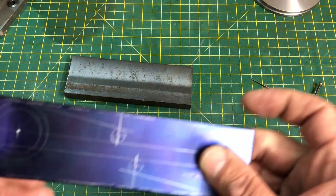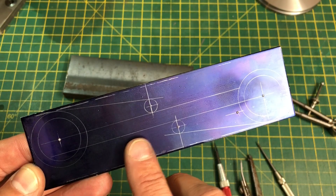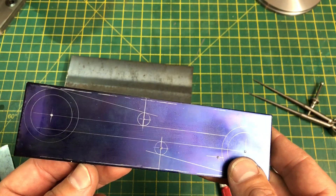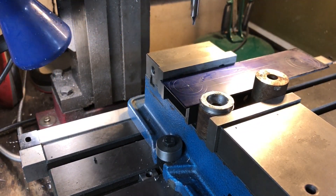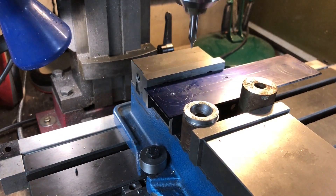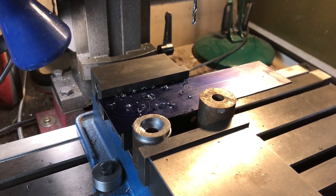Now I could have easily saved myself some of this material by shifting this component across and nesting it with the other, but I'm afraid I didn't bother to check before I started marking out, so I will just have to live with a loss of that 2 inch square piece of steel. Before I cut these out, let's take them over to the mill and locate those holes. I am locating the first centre punch with a wiggler, and then using the DRO to move to the other hole positions. The odd clamp hole is simply drilled, but I'm going to ream the matching holes on both parts so that I can use them for location.